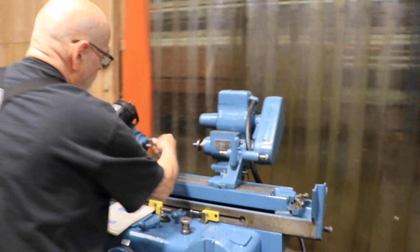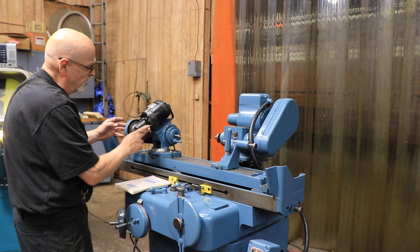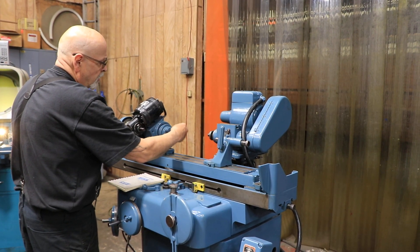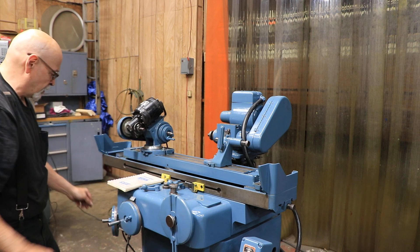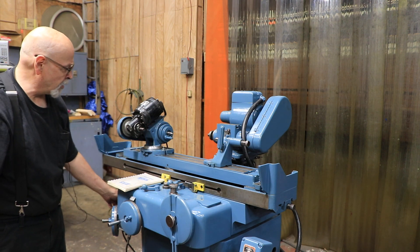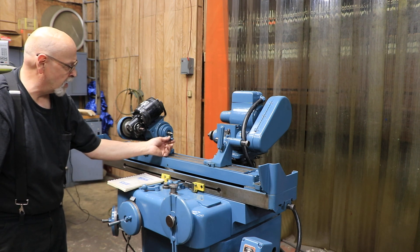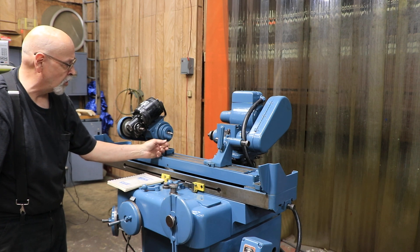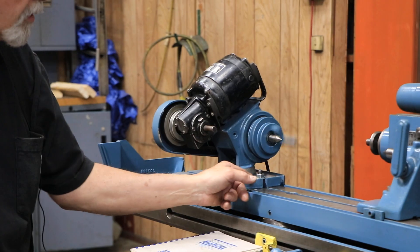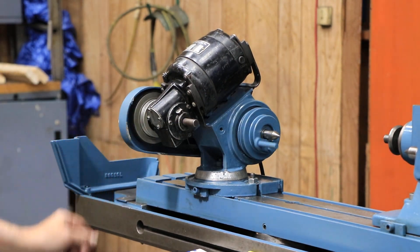Over here you actually take the belt off of this side and pulley and put it on here, and you'd be able to drive your headstock around your dead center. This is variable speed, and this is just hanging here because there's nothing to drive it. So normally you would want to just be driving this outer thing, the outer pulley with the driver dog on it. That's if you were going to use this for cylindrical grinding.